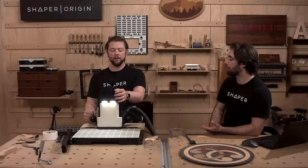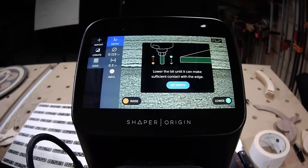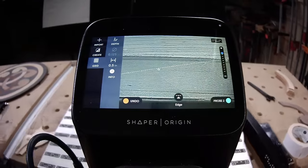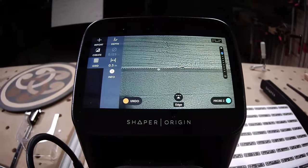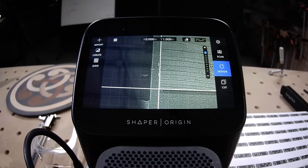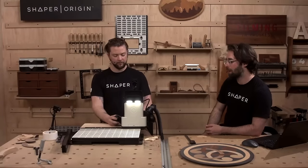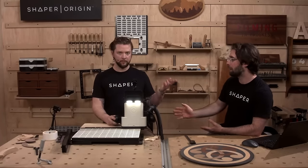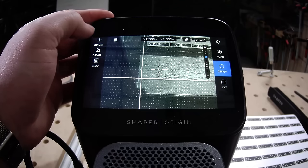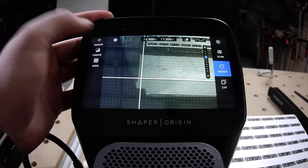And so what you're doing now is making a grid so that you can align this well-nested design space to this particular size wood cutout that you have. Exactly. If you remember from our previous shows, gridding is a really easy way to get reliable position relative to axes and a coordinate point. We're making those axes by probing against the workpiece, either with a solid probe like your engraving bit upside down, or, if you're saving a little time as we are today, just with the router bit. It's a little bit less precise, but it does still allow you to align things and return to them in a way that is still meaningful. In my case, plus or minus a smidge is okay. Totally okay. You're not aligning a tenon, for example.